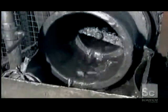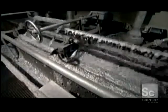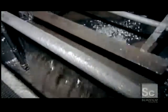At the surface, a crusher breaks the ore into small pieces. Then, adding water and oil, they pulverize it in a rotating mill. This ore soup then flows into a system that separates the graphite from the impurities. The graphite particles cling to the air bubbles and float to the surface. Skimmers send this layer of graphite foam back into the mill. Five cycles later, the graphite concentration is 96%.